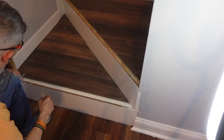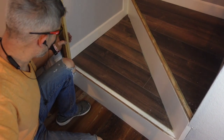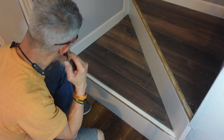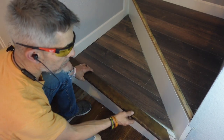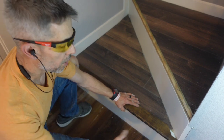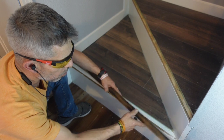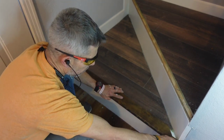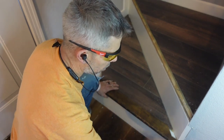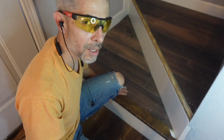Okay guys, I made a mistake. Over here we're fitting really good - I have my expansion gap and I'm able to lay it down and have a good amount glued and nailed, with my stair nose hanging over right there. But the problem is I got too far away from this edge. So what I'm going to do is use some CA glue and glue that piece back. Also I think this nose is sticking over a little too much - I'm going to nibble a little bit away, which will allow me to push it back. You'll never be able to see it, but I did want you to see that hey, I make mistakes too - I just got to figure out how to fix them. Structurally you'll be fine because this is the part you step on.